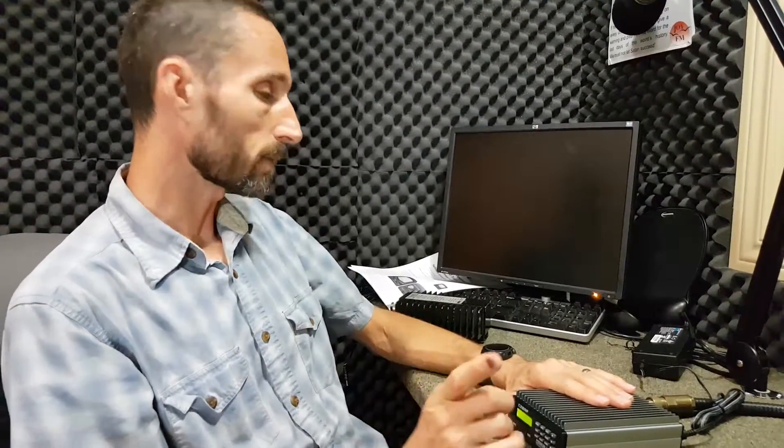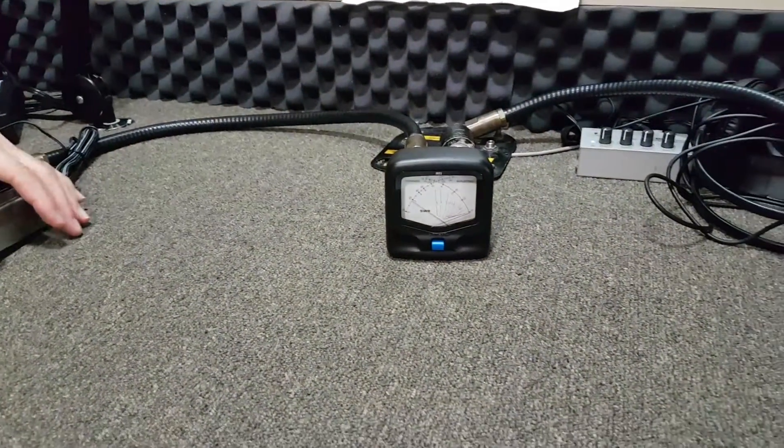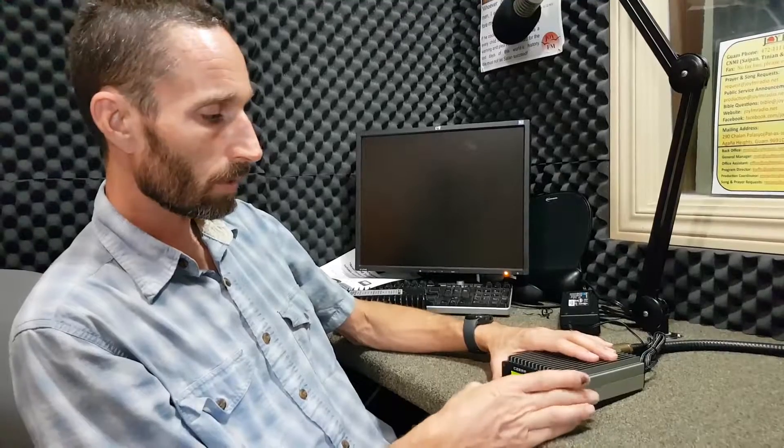If you can't figure out what's going on, call us in Guam. So that's testing with the watt meter. One more thing regarding the dummy load: you do not want to run the dummy load with the transmitter at full power for more than about five minutes. The dummy load is only for short-term testing - it can become very hot and you could burn it out. You could reduce the power and run it a little longer, but you shouldn't need to - you're just doing short-term testing to see if the readings are correct.